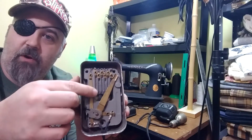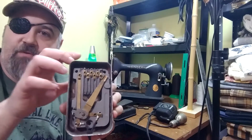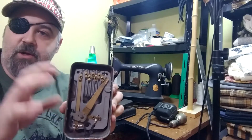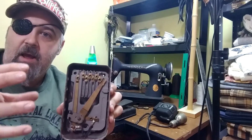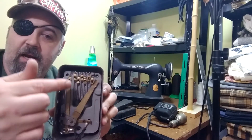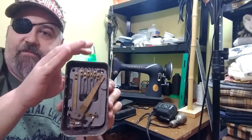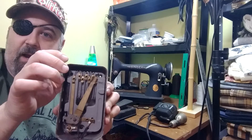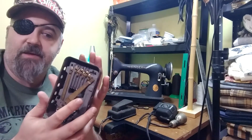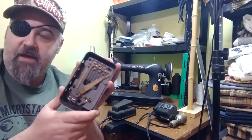Hopefully you guys can see there's little coils here running in these little channels. What those are designed for is, when you're only calling for this much power to go out to the motor, this pedal has to do something with all that extra energy that is supplied to the pedal. So it sends all that extra energy through these coils, creating heat, just like a toaster oven. If you're running your motor in this area here constantly, this pedal is really going to heat up on you fast. And there have actually been reported cases of fires started using these pedals and setups.